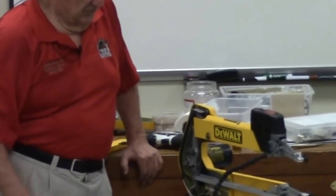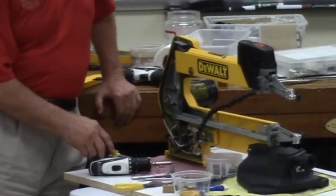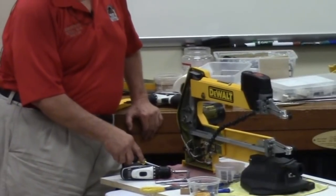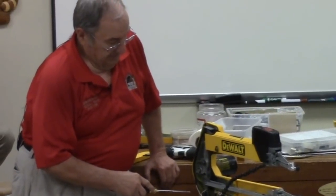Okay, when I told you to pay careful attention to the content of the bottom of the machine, if there is dust, black dust in particular, down in there, that is usually giving you an indication that something above it is wrong. So when you start disassembling that thing carefully, be looking for black dust emanating from whatever connection you have just taken loose. Because that will give you a strong hint as to which bearing has gone bad.